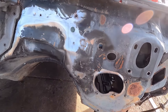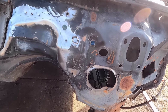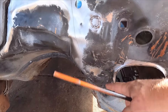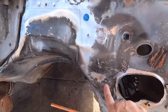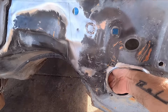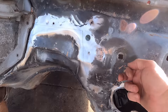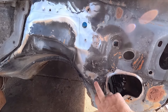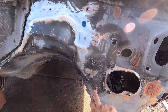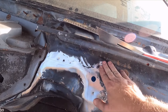I need to get these nuts off of here - I'm going to try an air hammer and see if I can get these knocked loose, hopefully it doesn't tweak the metal too bad. I need to grind this metal down flat - the metal is pushed out here because the screws go this way for the gas pedal. I need to grind this down flat, open the hole up, and lay some bolts in there. Hold them in place and weld it out here, then go inside and put some welds on the outside of the bolt to the firewall for more support. That'll end up being stud-mounted.